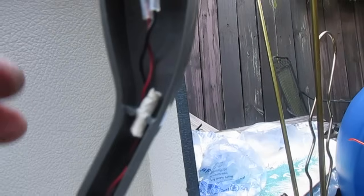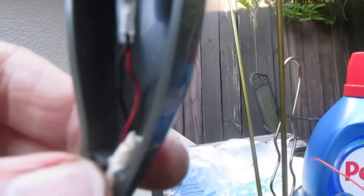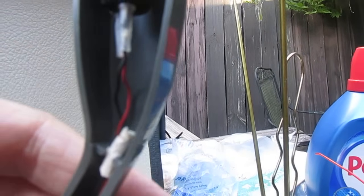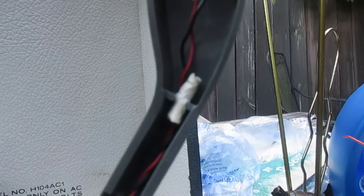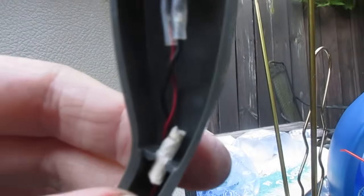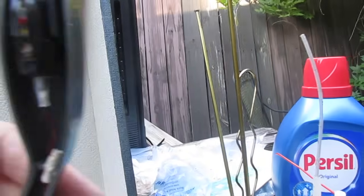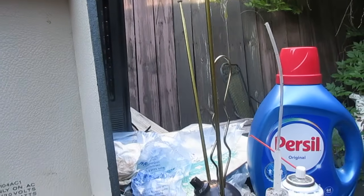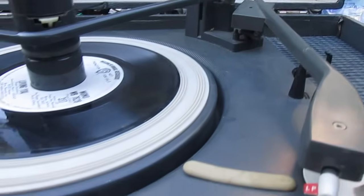And I had to jake leg one of the little pegs that holds the tone arm wire up in there fell out. Lord only knows where that is. So I just cut off a piece of a Q-tip, wrapped some masking tape up around it, and jammed it up in the hole there, and it seems to be working. Probably put a dab of glue in there to hold it in place, but right now it'll be okay.